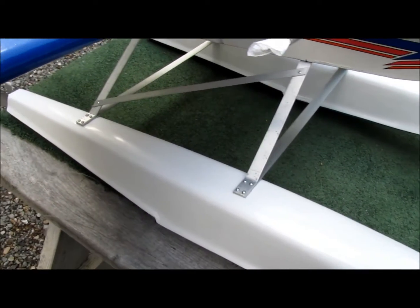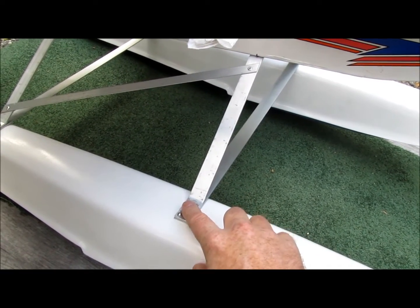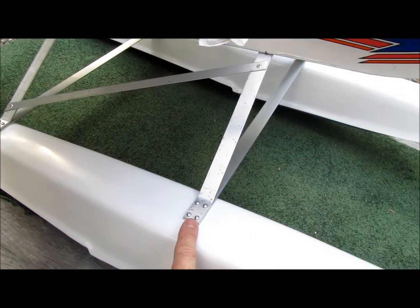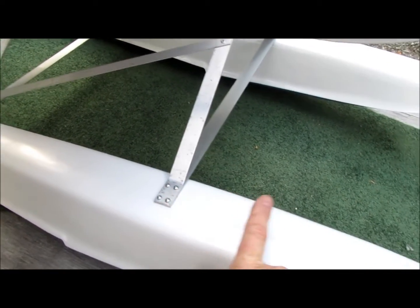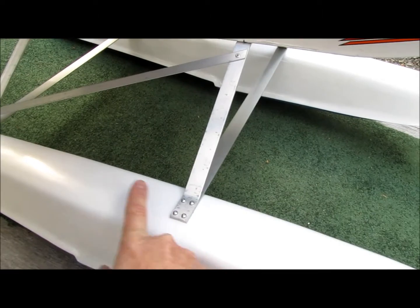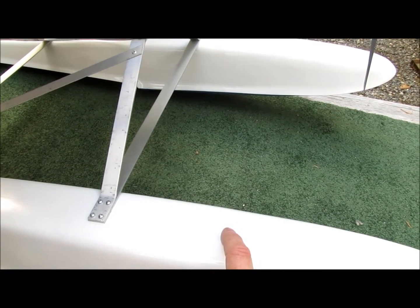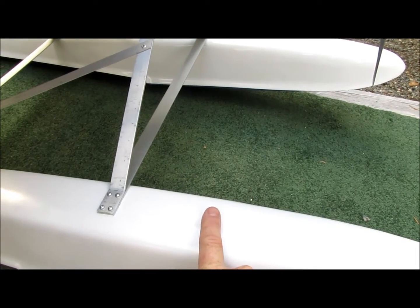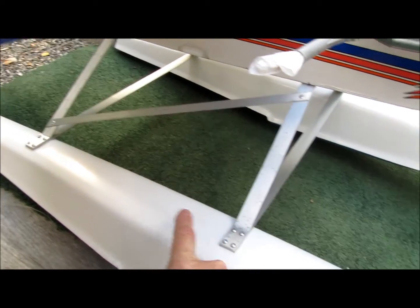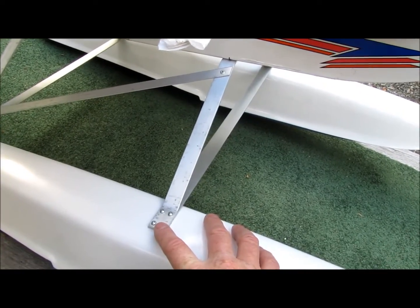The 38 inch floats have two hard points where there is wood on the inside of the fiberglass so that you can mount the hardware to them. There are only two hard points. They are marked on the floats and there is a little hole drilled in so that you can see where they are. Do not try to screw the main strut to any other part of the float because there is only fiberglass there - there is nothing to screw it onto. If you have to mount it to a different part, take a little piece of plywood and glue it firmly with epoxy, rough it up a little for grip, and then you can make your own mount. I used the factory mounts and it worked just fine. Look for the little hole and you'll know where the hard points are. They provide four screws of attachment at each point and they have proven to be very strong, giving a very rigid mount.